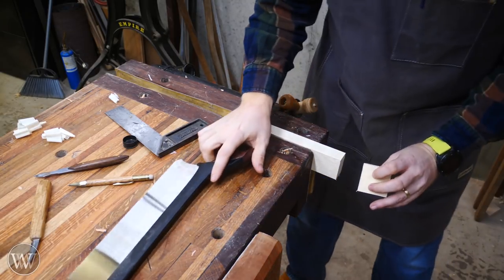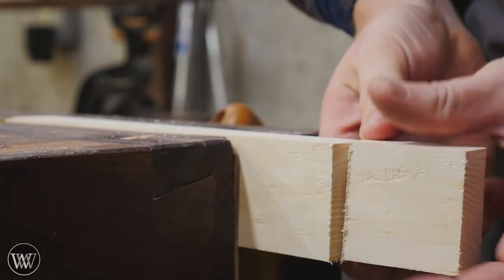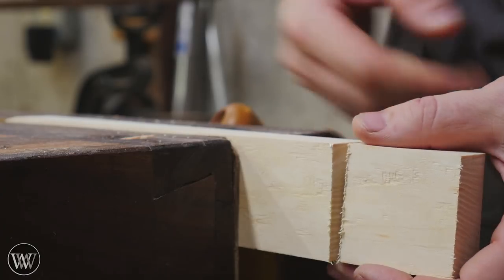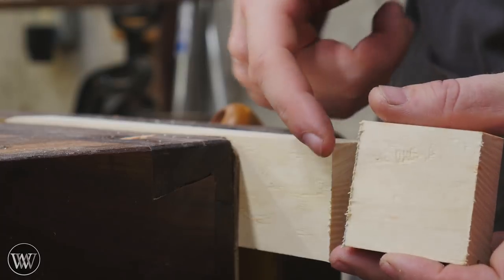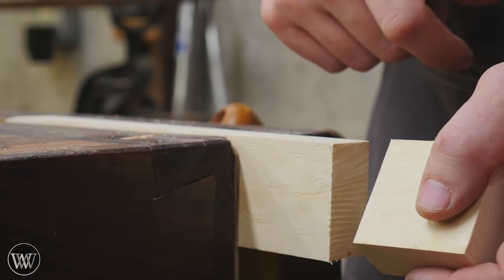With that being said, it's a third-class cut — it doesn't need to be pretty, and if I'm not following the line, then I'm not following the line. Now one of the things you're going to notice is there are a lot of burrs on the backside where it has pushed off the back fibers. So this is not going to be a really nice cut. You have to clean those up, and you're going to have a slightly rounded corner.